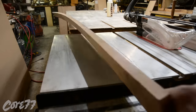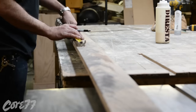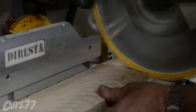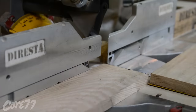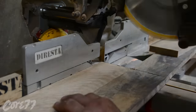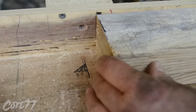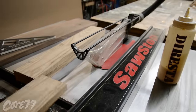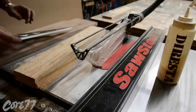I'm going to put one clean drawer underneath the lathe, because that's where I need to reach most often while I'm working. Here I'm using an old piece of oak that is considerably bent, but I think I'll be able to use short enough pieces to get that bend out. I'm making sure I'll have at least three sides in oak and one side in walnut, and I'm going to finger-joint everything together. There I am making sure those three are the exact same size, trimming the top and bottom with my SawStop.